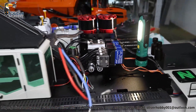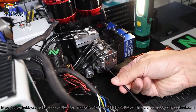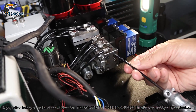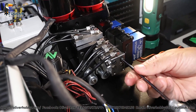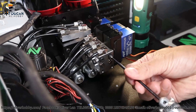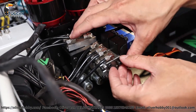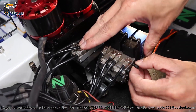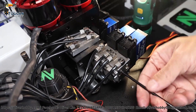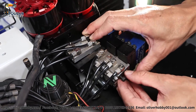We will remove one by one. I already loosened them, so easier and quicker to show you. Take out all. After removal, the remaining oil inside will all come out, so put tissue paper underneath for easier cleaning. Now this one is already removed. The hose is giving tension, so I need to push it a little bit and then this one I can directly pull out. Number four long screw — take it out, and push and pull it out.